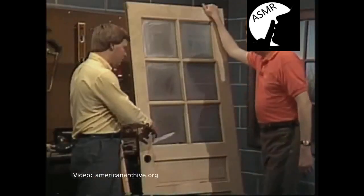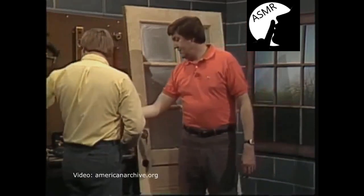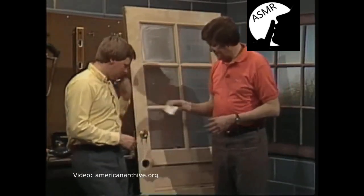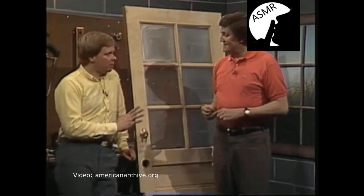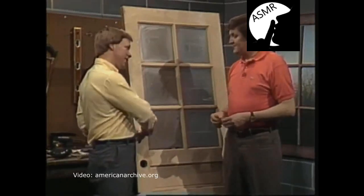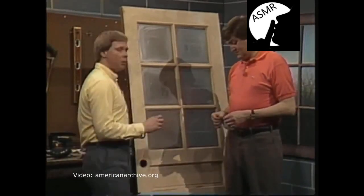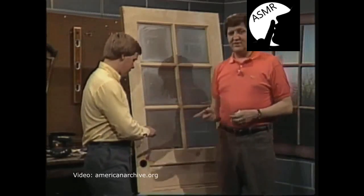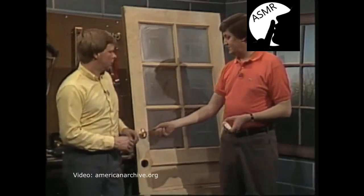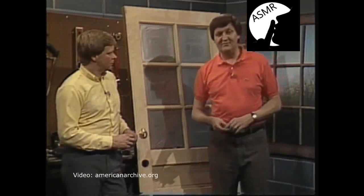It's pretty easy once you get down to it. The biggest thing is making up your mind to do it and being brave enough to drill a hole in the door — that tends to worry people. But once you've made up your mind, it's pretty easy. One tip: this lock is excellent for keeping someone out, but it's also excellent for keeping you in if you lose the key. Make sure you keep a key near the door — but not within arm's reach of a breakable window — somewhere accessible in case of fire. Do not keep the key in the lock itself, as a burglar could break the glass, reach in, and open it.